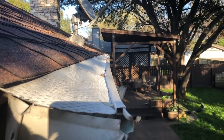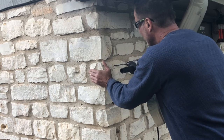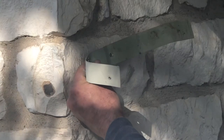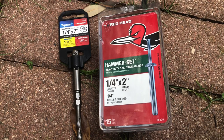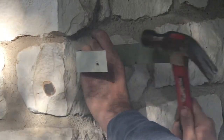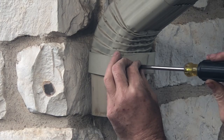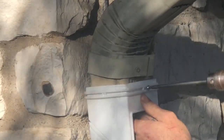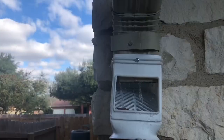Don't forget to install leaf filters on all your gutters — that's an important step not to overlook. After I removed my downspout I had to adjust the bracket a little higher because it was holding the downspout, not the elbow, so I had to re-drill a hole and adjust the bracket height. If you need to reattach into masonry, these hammer set anchors make it really easy — just drill a hole and tap them in with a hammer. The leaf filters on your gutter aren't going to catch everything, so I recommend having another filter on the downspout called a leaf eater. There are a bunch of them on Amazon, and I picked up a cheap ten dollar one at Home Depot and cut it because I didn't have a lot of vertical height.